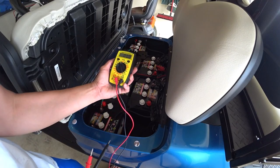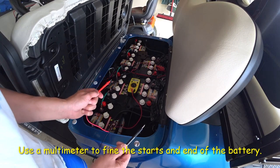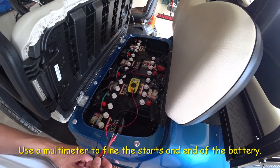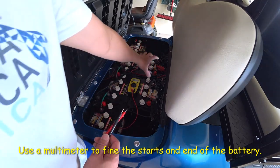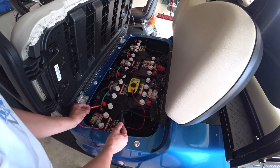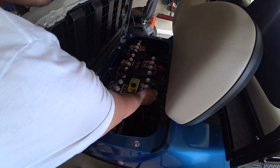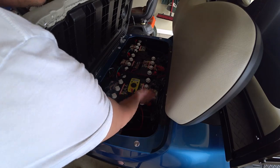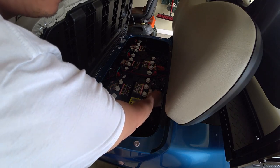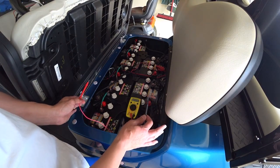What we need to do first is grab a multimeter and find the start and end of your 48-volt battery. As you can see, there are six batteries here. To know exactly where to connect, use a multimeter — positive and negative. You can see here it's reading 16.8 volts, so that's not the end point. You're looking for 48 volts or above.